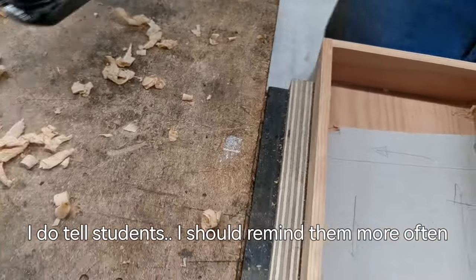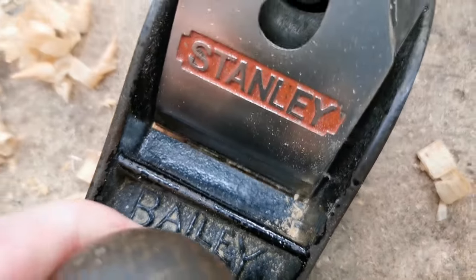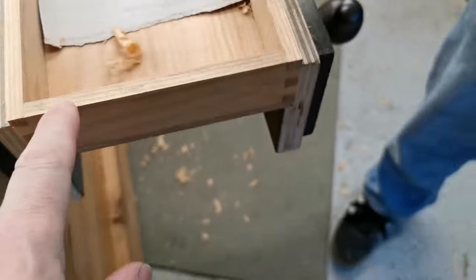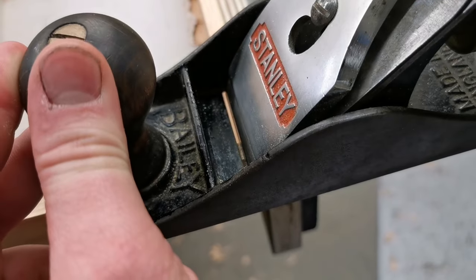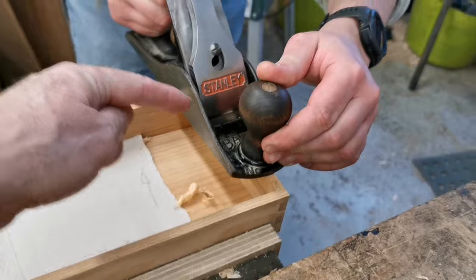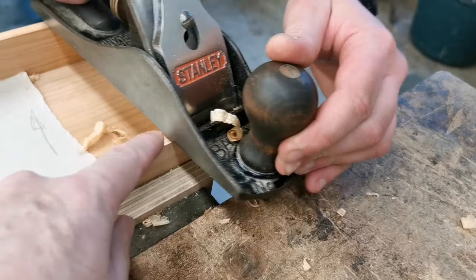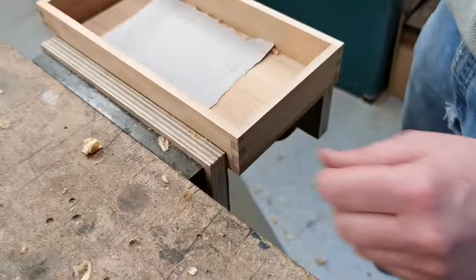When you're planing, just drop your plane on there. Adam, when you're planing something, you can look through that gap in the bottom there, and when you're putting the plane, just drop it in a position to plane this off. What I've just realised is that people are planing without an understanding — look at the shaving, look through the mouth, stop the blade before it rips into here and rips the side off. That way you'll get more accurate.